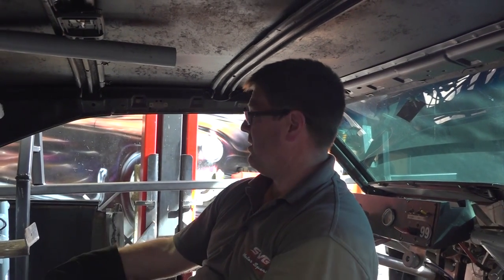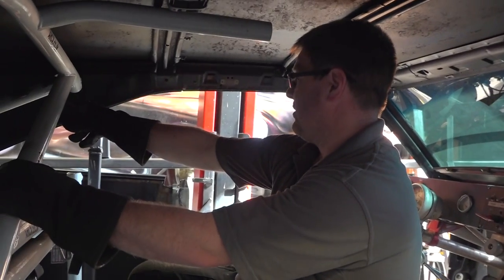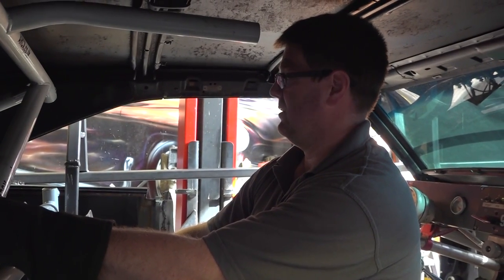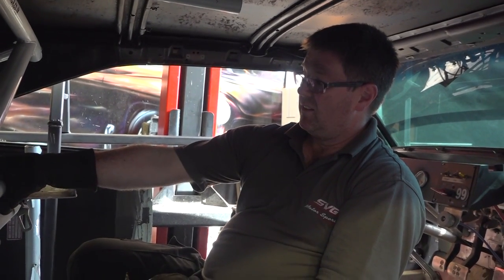So what it would mean is these rear diagonals that we've put in are not going to work where they are. Okay, but they can move slightly, can't they? We can move them this way a little bit. Can we cut like a centimetre out of that bottom sway bar? This one? Yeah. And then that whole piece will come this way a tad, which is what we need. That'll bring it over a centimetre and it'll drop it down a centimetre.